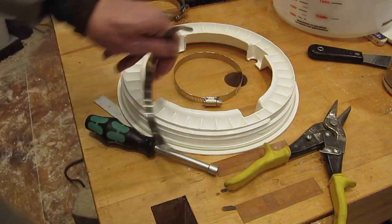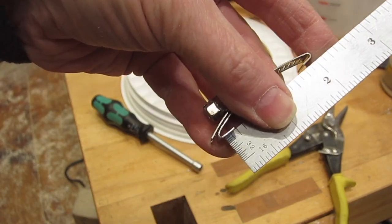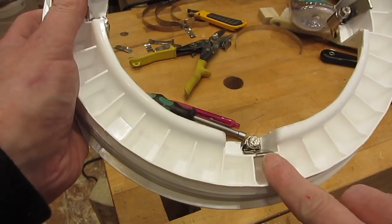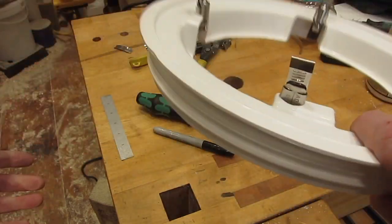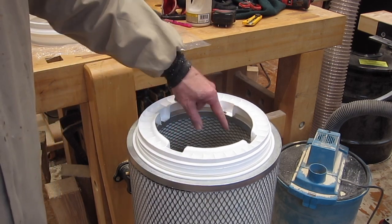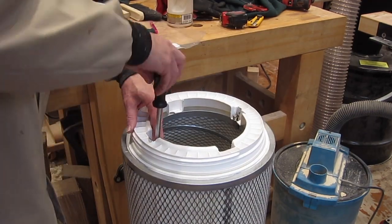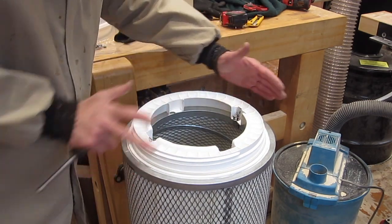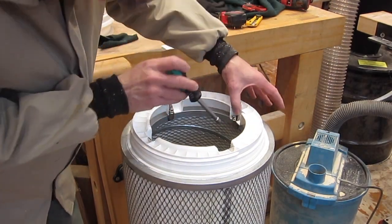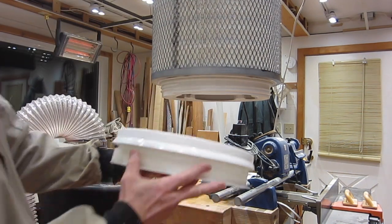I cut apart a band clamp to make a small gear clamp — you need a capacity of about two inches. I mounted four gear clamps to the gamma lid, with the bend made tight enough that it grips the plastic so they don't fall out. I'll also epoxy the other half of the gamma lid to the filter because I don't want to rely entirely on the mechanical fasteners. As I tighten these clamps I keep an eye that it doesn't shift — that's why I put one on each side before tightening. You can't tighten these too much or the band clamp material will just bend.